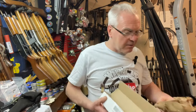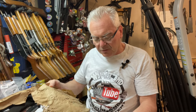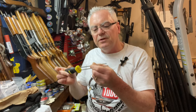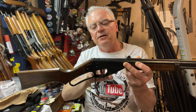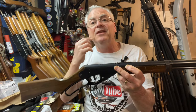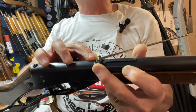John actually makes these tools and sells them on eBay — I'll put a link to his eBay store down in the description. He has two different tools and I'm going to have to do a little research on which one does what. One of them has thicker rods. The deal with a Daisy — let me grab my old Red Rider here to show you — is that when you go to rebuild one of these Daisies, you take off the stock, the cocking handle, and the trigger. The next step to getting the gun apart is you take a tool like this with rods and stick it in from the back until the spring is pushed up against the spring block.